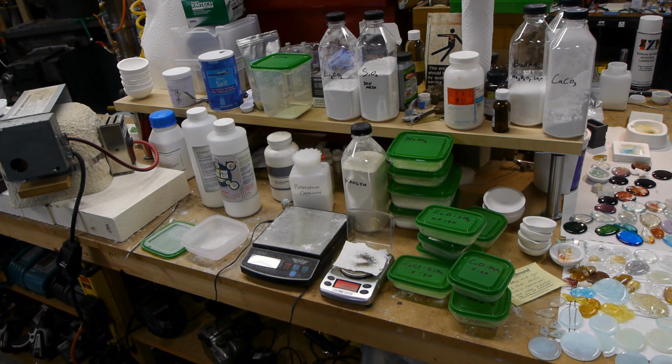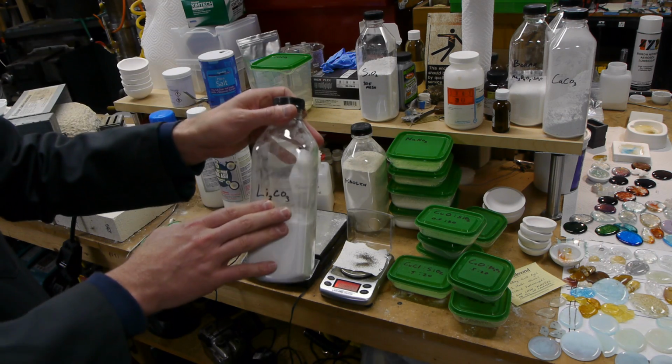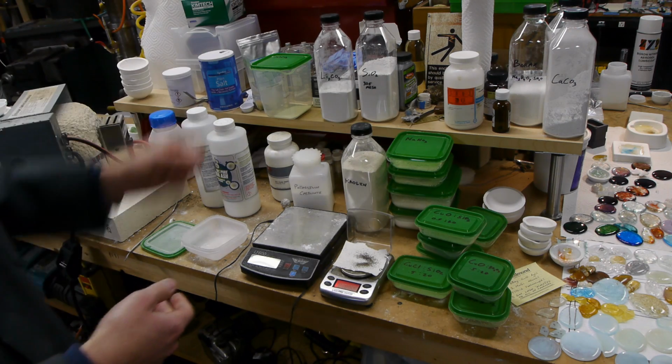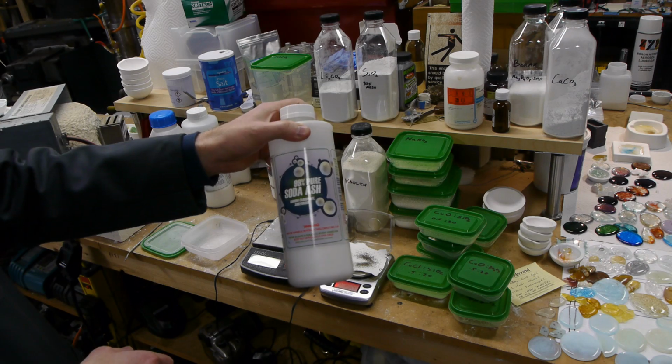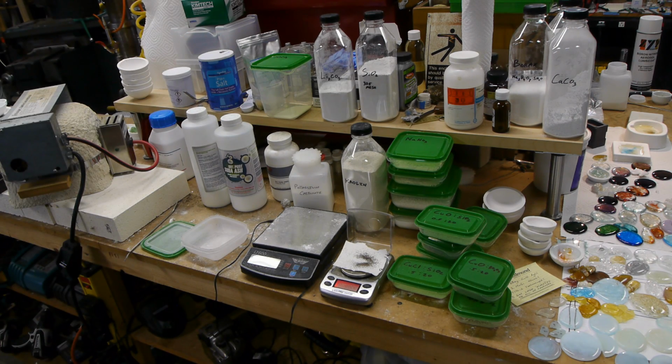Luckily, a lot of this work has already been done. So if you sit down and you want to put lithium in your glass, you pretty much use lithium carbonate. There might be a few other chemicals that work too, but pretty much it's always lithium carbonate. And also, for example, if you want to add sodium to your glass, pretty much using sodium carbonate is the way to go. Unfortunately, there's not a master table or anything that I've found that lists all the possible things you can put in. I mean, there's literally hundreds. It goes on and on. But to make more normal kinds of glass, it is pretty well figured out, and I'll put as many links as I can in the description to help you out.